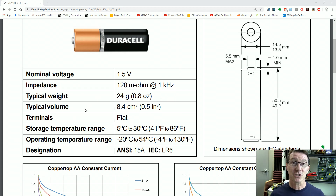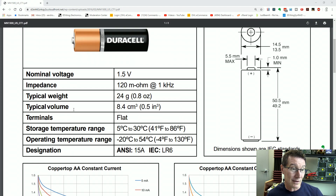You've got to pick a frequency — it's just like why every oscilloscope has a 20MHz bandwidth limit. Why is 20MHz the standard for measuring power supply noise? Check a power supply datasheet — the noise will be measured over a 20MHz bandwidth. Why 20MHz? Because scopes have a 20MHz bandwidth limit. It's just an industry value the industry picked, a de facto standard. Anyway, 1kHz for battery impedance — there you go.